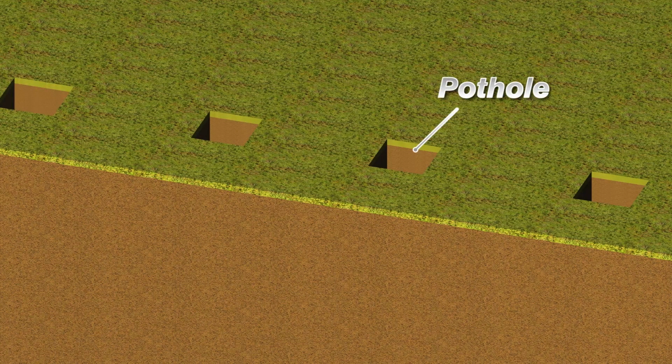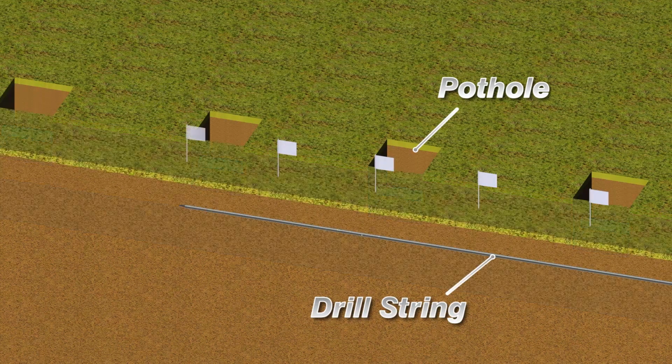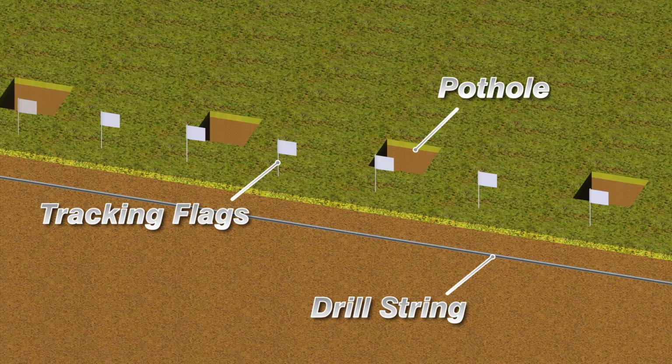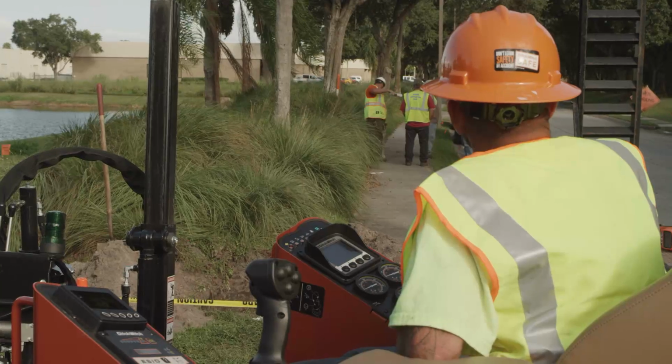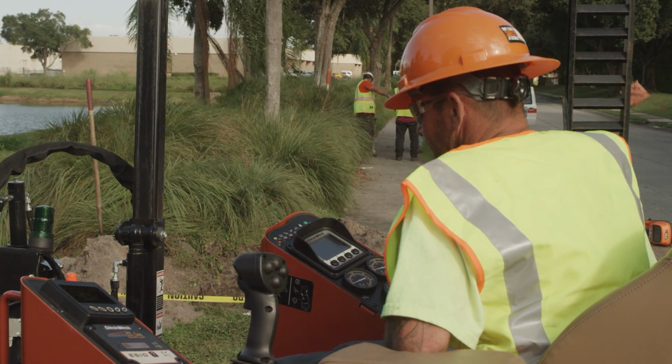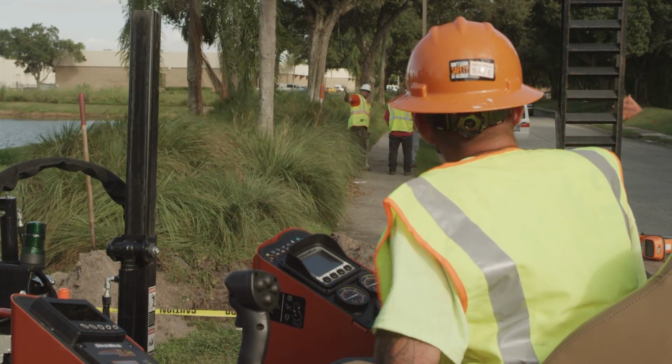More frequent tracking is needed to ensure the tolerance zone is not encroached, and more frequent potholing is needed to verify the location of the utility. Also, if not tracked frequently, the drill head can slip into previously disturbed soil where the existing utility is located. Follow all local guidelines for tracking and exposing utilities when drilling parallel to existing utilities. An experienced operator may think a utility is always buried at a certain depth, but the depth of a utility will vary. Never assume depths.